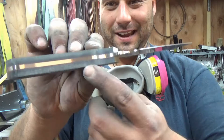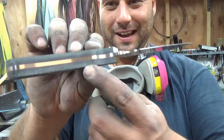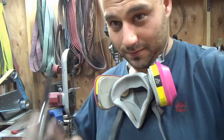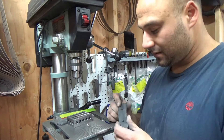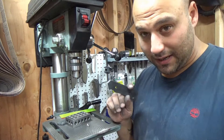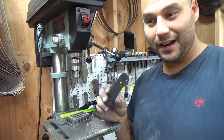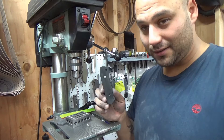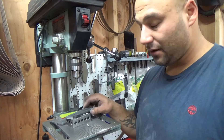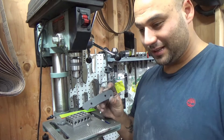I went back and cleaned up that finger choil — that's 400 grit, I'll probably take it up to about 600 later to match the bevels. Now at the drill press, I've got my 5/16ths masonry bit all mounted up in there. Got my 1-2-3 block for a base. Now, don't make the mistake I made — I made a bunch of scales and then tried to do the holes after I contoured them. That's a no-no. The scales got ruined and I had to do it over again. With these ones, we're going to lay it nice and flat. If you have to mark them in big letters, make sure you do that — because if you do it backwards, you're in trouble. Red side in for us.